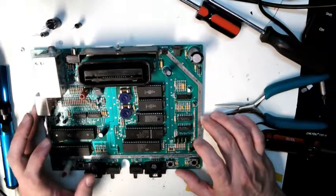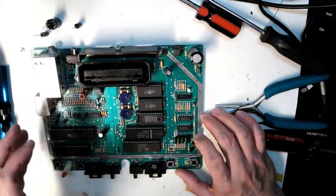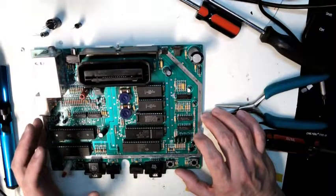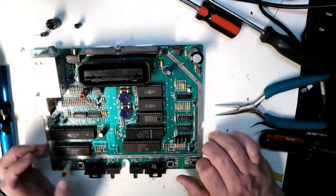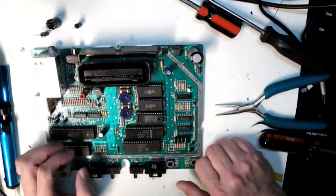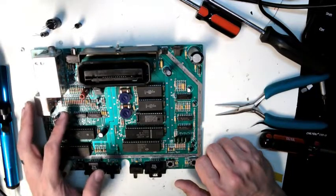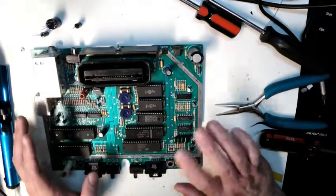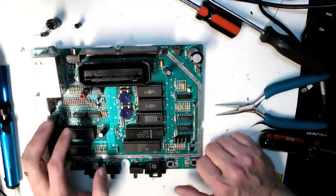The 7800 is kind of interesting because it's a stripped-down Atari 8-bit computer combined with an Atari 2600, so it has the chips for both. So when you add the S-Video or a composite mod, it adds a slight challenge because there's actually separate luma and chroma. One is slightly different from the other, so you've got to mix the signals together. So we're not up to that point yet.